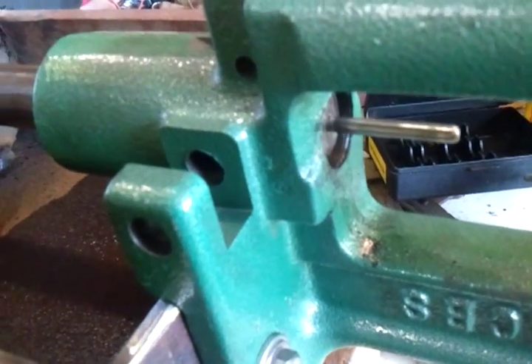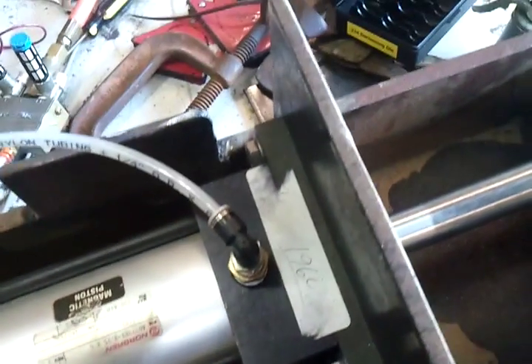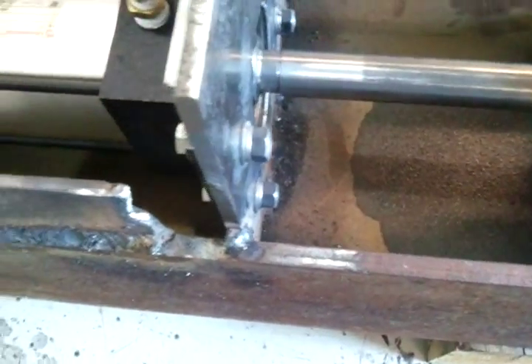The de-rimming punch is sitting at the end of the ram and threads directly onto the end of the cylinder ram. The cylinder, in turn, is mounted to a plate that we welded onto this piece of I-beam. It's 1/4-inch hot-rolled plate steel, which seems to have plenty of strength. The cylinder has a flat mounting plate with four bolt holes, and we were able to drill some 1/2-inch holes and use some 7/16ths bolts, giving us a little bit of adjustment room for both the cylinder and the ram to get good actuator activity on the tool.